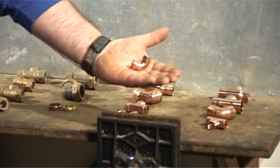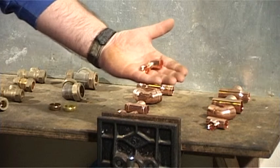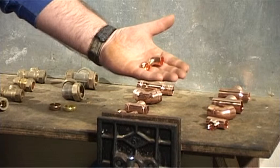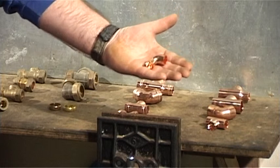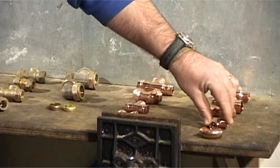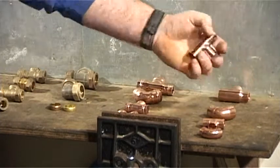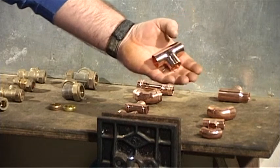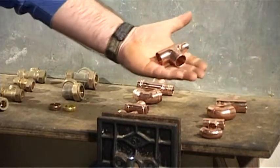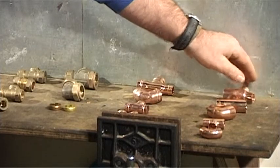They're called end feed because you must add solder to the end of the joint once you've cleaned it. These are the cheapest version available, which means there is a lot more work, as you have to clean all the joining surfaces, add the flux, add the solder, and the heat. These are available in different sizes, the main ones being elbow, T-piece, 15mm T-piece between 22mm, and various shapes and sizes, working your way up.